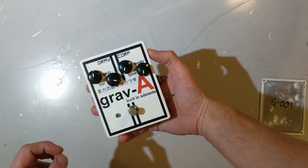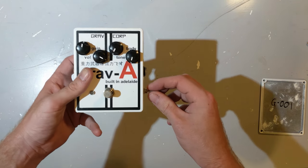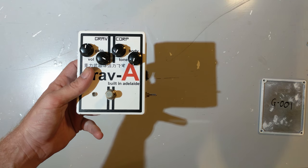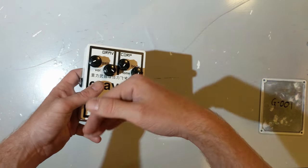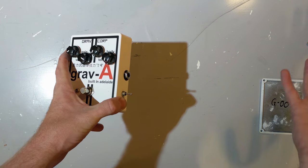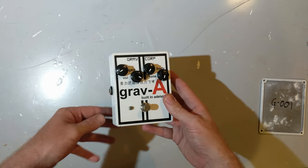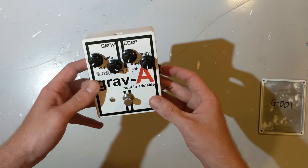Now, also hanging off the gain stage are some diodes connected to this switch. In the center position, the diodes are disconnected. The gain basically controls how loud the signal gets, and you can use it to overdrive your valve amp into distortion. Very good. However, sometimes you want the pedal to create some distortion of its own.